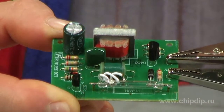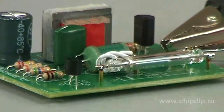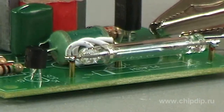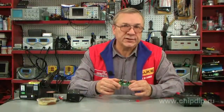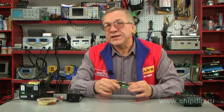After that, the thyristor is closed and the cycle repeats. The device is built on a compact circuit board, and if you want, you can later place it into a small frame. The stroboscope works from a stabilized power supply at a voltage of 12 volts. The current consumption is no less than 200 milliamperes.